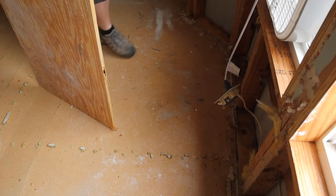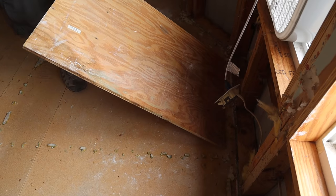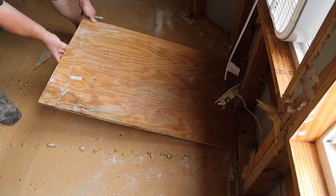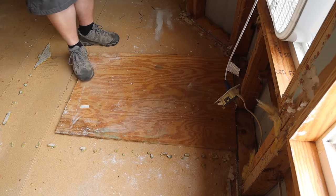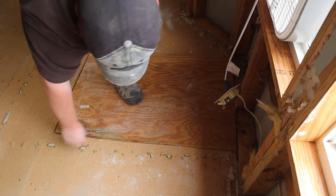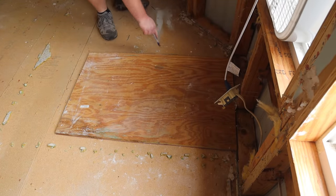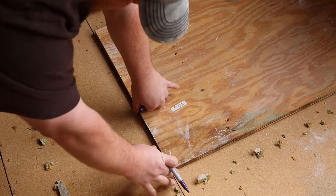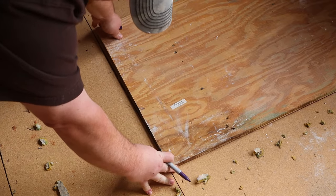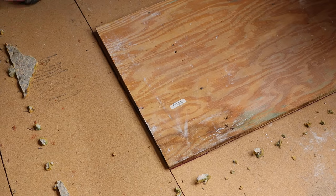To patch: take the plywood and lay it down on top of the floor, pushing it all the way up against the wall to square or parallel it to the wall. Then take a Sharpie, draw an outline around the board, and move it back so you end up over top of a joist. While this is not a perfect example because this piece of plywood won't exactly fit my spot, it gives you an idea of how to use a square object to find perpendicular lines from your wall and scribe them back to your floor joist, then measure to cut your piece.